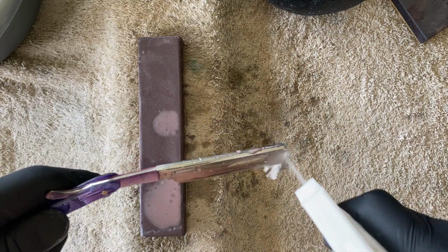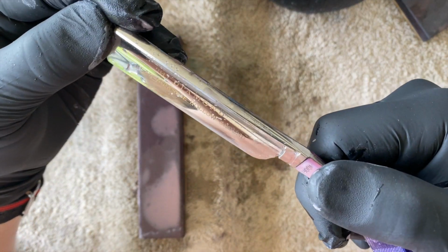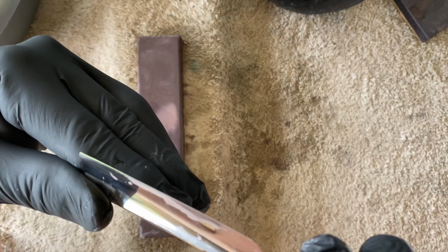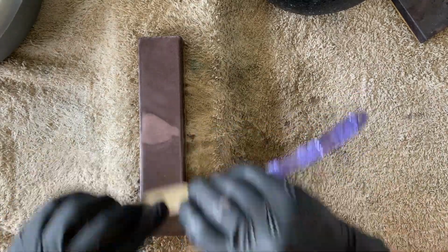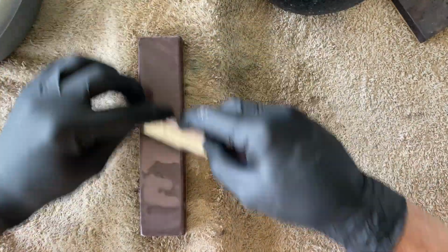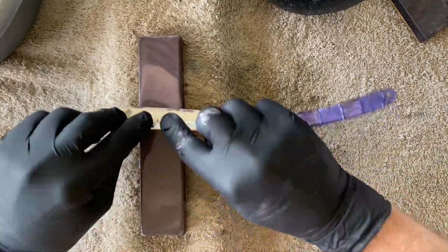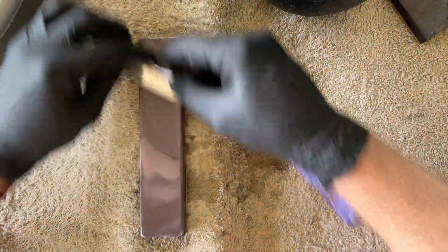So as with most things in honing, stop on a regular basis and start inspecting to ensure that what you see and want to achieve on the stone is actually happening. A Belgian Blue is generally graded, if you had to compare it to a synthetic grit size, around the, I would say, 4000, 4K mark. But you would see it cuts actually quite quick and fast, even for 4K.